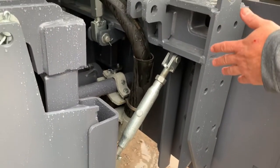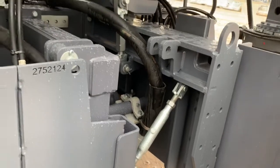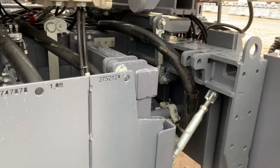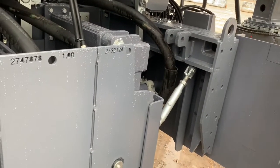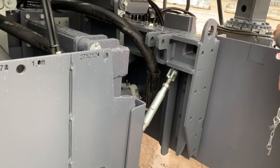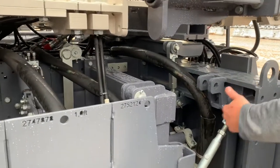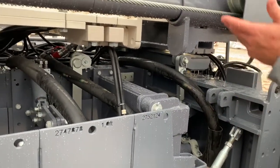These are open-ended metering gates — done for transport. The open-ended metering gates allow fresh concrete to flow through the side. When we were talking about having soft edges on a military base job, you would use your plow to push the good fresh concrete right over to the edge, because you want heavy aggregate stuffed into the edge.